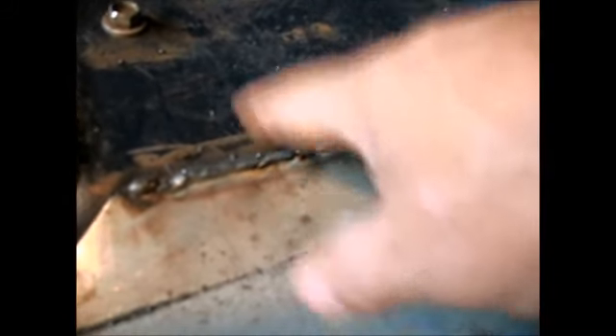I was up here doing some welding, and I wanted to show you my welds, because I did just the opposite of what most people was telling me to do. Most people was telling me to turn my heat up and my wire speed up, and I had this one guy who said turn your heat down as low as you can turn it, and adjust your wire speed just right, and push your weld, and you'll get your best weld — and he was right.